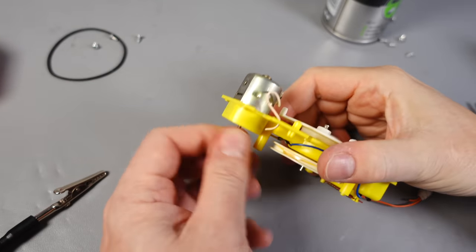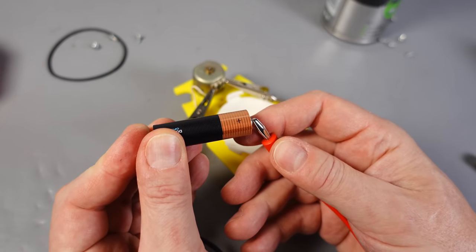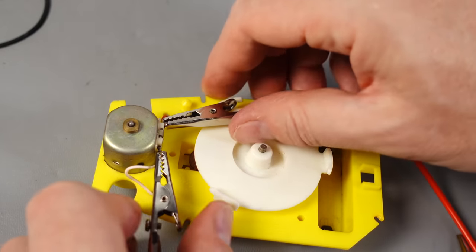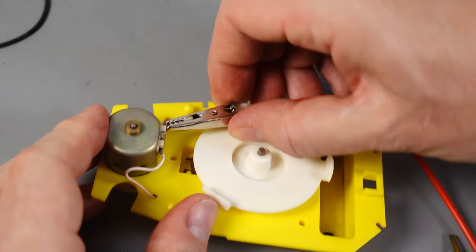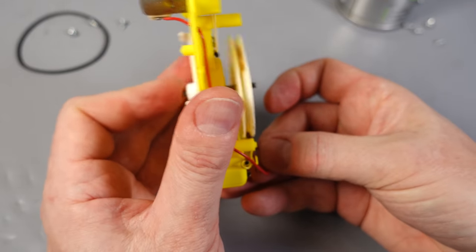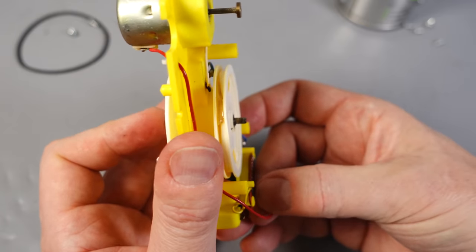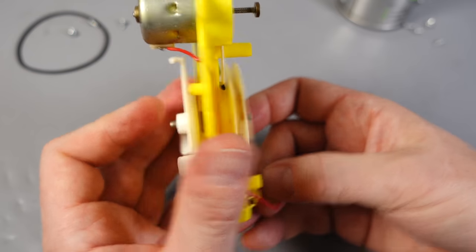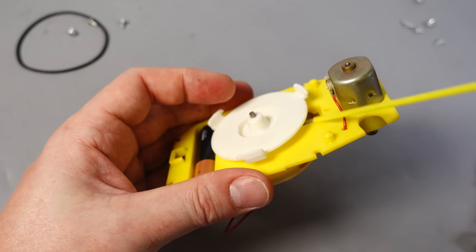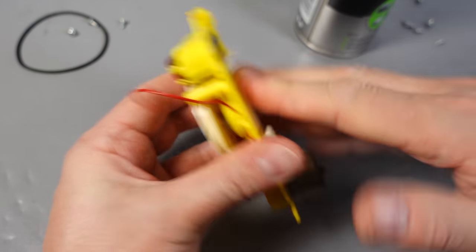That's drenched it. Let's give it a spin. Motor spinning! As far as I can tell, that seems to be running pretty cleanly now; I've run it for a couple of minutes. Let's see if the rest of the contacts actually work. That's not working — hold on — it is, just about, reluctantly. I'd suggest a load of contact cleaner down the middle here — it's like the solution to everything today. If I just make sure this scrapes those off, we should get a good connection in the middle.